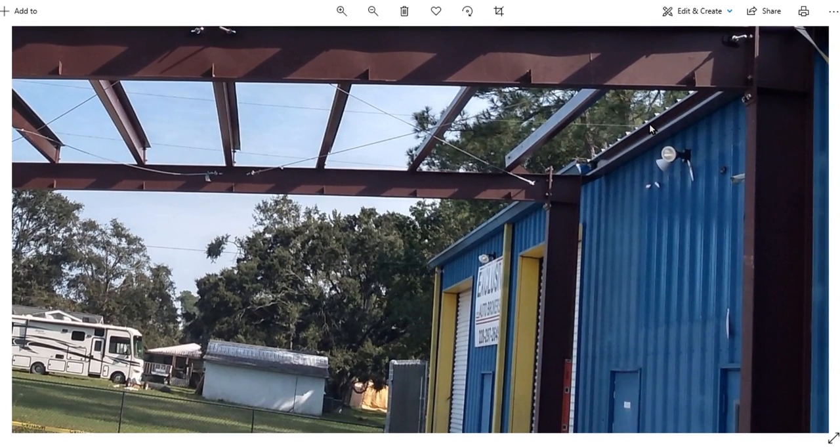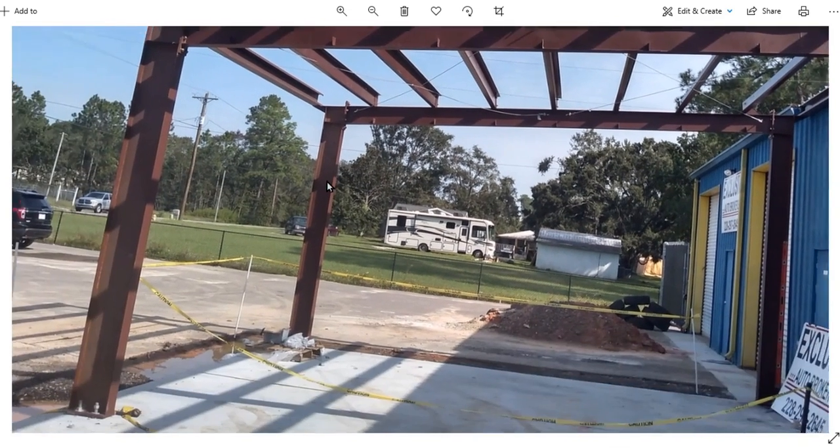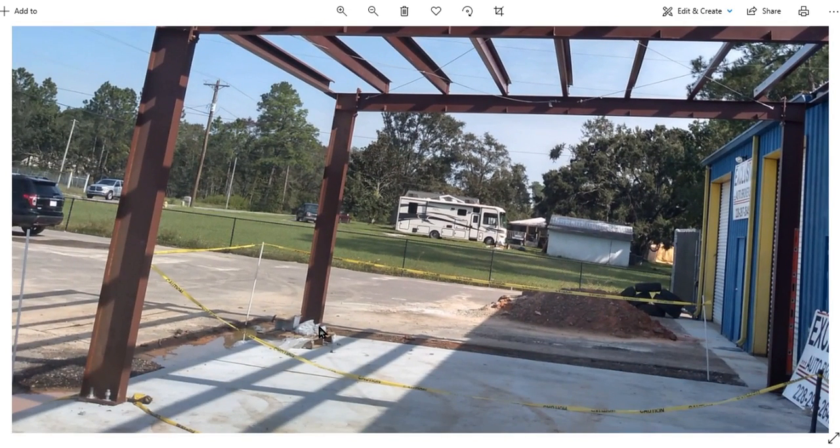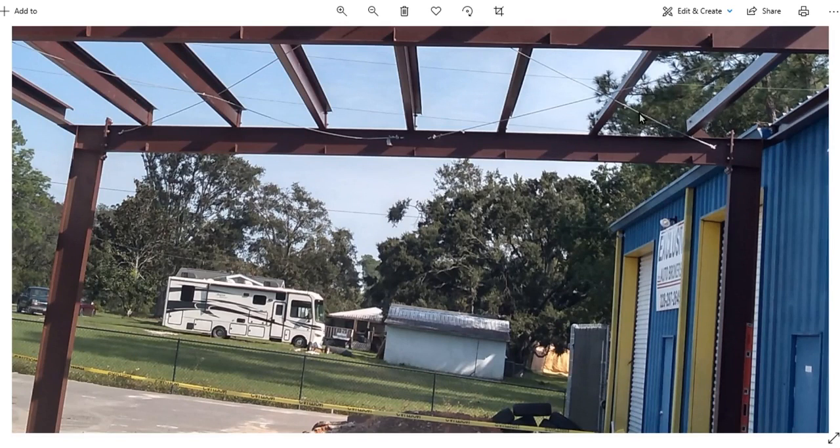I got this adjusted where I wanted it and screwed it to the overhang of the building, and leveled this up — leveled these columns as much as I could. The bottom isn't quite right, but I got them both leaning in the same direction. I've got a little red iron angle that'll screw over here. I'll start sheeting it as soon as I can get them to open that back gate. Nobody showed up to work today — seemed like they sold all the cars yesterday. I'm working on getting somebody out there to unlock the gate so I can get my sheets out the back.